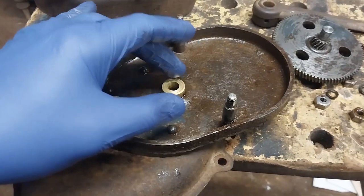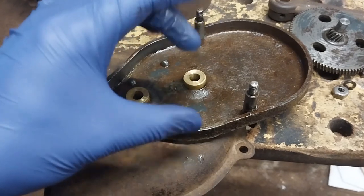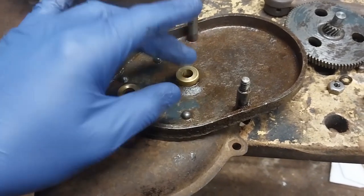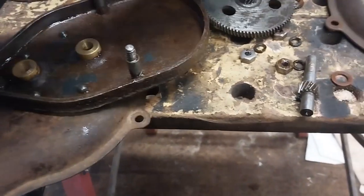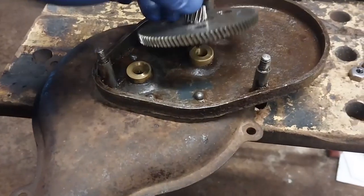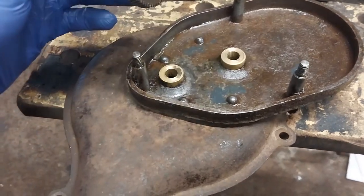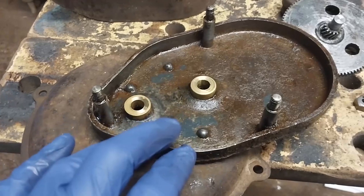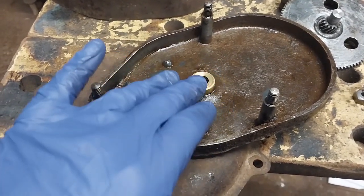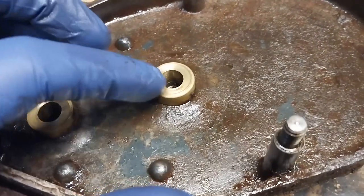This is super cool. Rather than having ball bearings, you know, the ring style, donut style ball bearings, they have phosphor bronze bushings, which when you take a nice hardened steel shank and stick it in there, it spins very, very smoothly because phosphor bronze kind of acts like a natural lubricant. So it's a cheap way to have very reliable lubrication and smooth movement on a rotational plane.